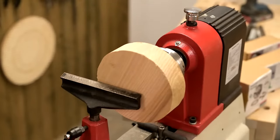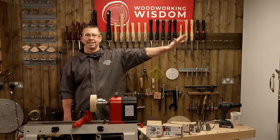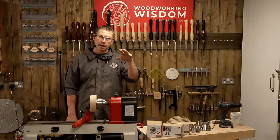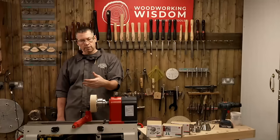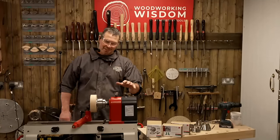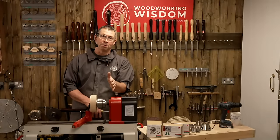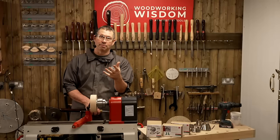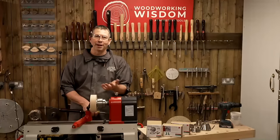I'm going to keep this really, really simple. I've got a recess to create. Lathe speed to zero, turn the lathe on. We're in February now, so Christmas isn't completely distant — there are probably a lot of you who have been gifted or bought your first lathe since Christmas. This is the sort of project you want to start with. Don't go big. When people get a lathe and put the biggest blank on they can, that's when you get big catches and you get put off the craft altogether. Keep small, keep to smaller projects — they'll look after you better.